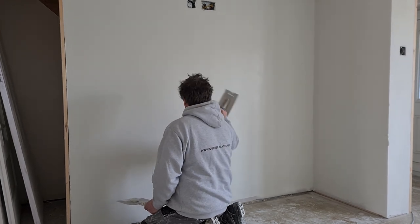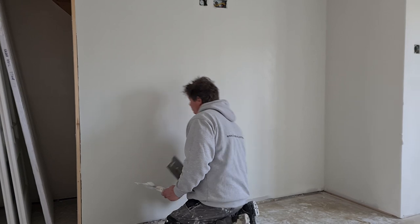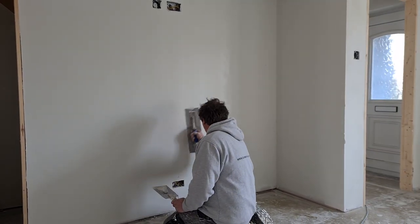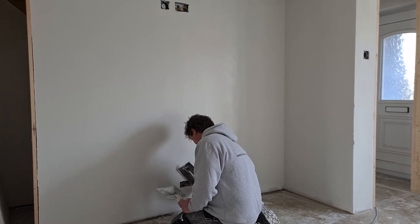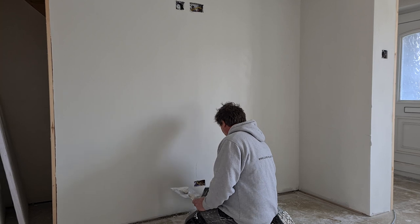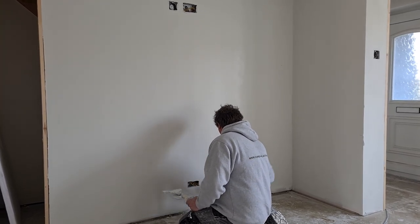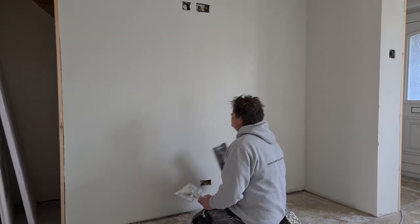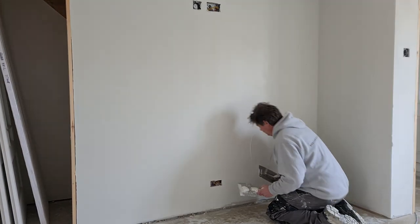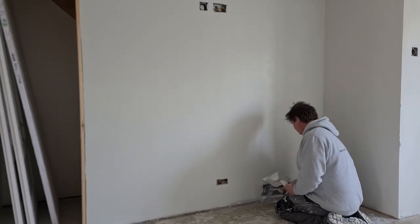Obviously, the more moisture you add to the system, the longer it takes to dry. When going down the ceilings, do you come down the wall? We come down at least a foot, and then we don't get spray onto the ceiling once we're finished. And we do that, obviously, the same when we're doing the internals of the walls. You've seen the technique when we're trailing up, so hopefully that's all your questions answered. Richard Formby, obviously they're the same questions, so hopefully I've covered them for you.